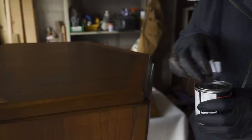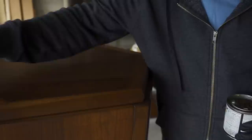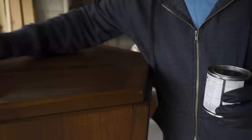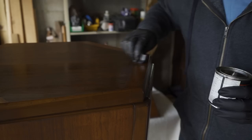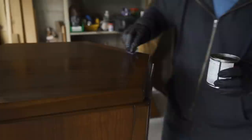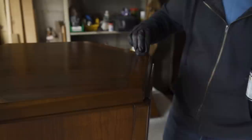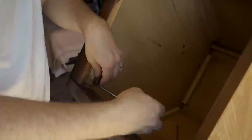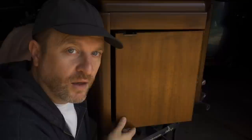All the stain is dry and the shellac is dry, and now I'm just going to add some wipe-on oil polyurethane to the top. I think everything from the top down I'm going to leave as shellac — should be fine as long as nobody spills an alcoholic drink on it. Just a couple of things left before I wrap this up, and one of them is to lower this latch a little bit so the door catches it better. I added a little piece of masonite to the bottom to bring it down, and then I can put the door back on.